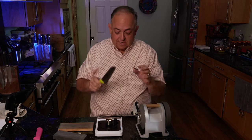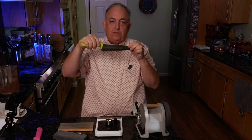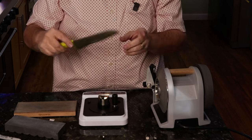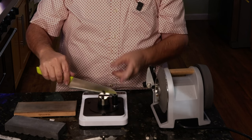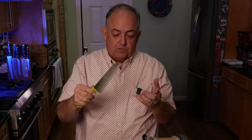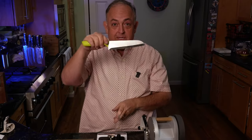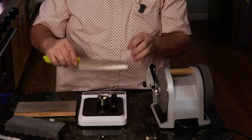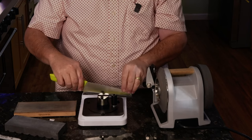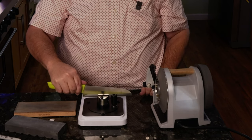When you run the BESS test, place the knife in the fulcrum on the device and slowly apply pressure until it breaks. You don't want to slam it down or run it across — you want to put it in the fulcrum properly and apply a nice, slow, easy downward pressure until it breaks. You can put the tip up against your finger to stabilize it and test that area of the blade. I usually align a logo or marking on the knife across the test media so I know I'm testing the same area. Going to go ahead and press down slowly now.